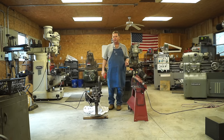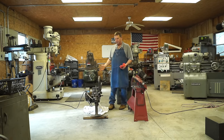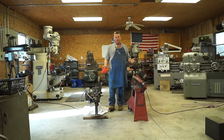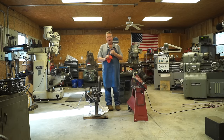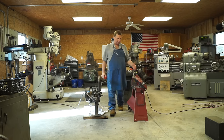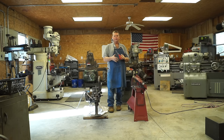My intention isn't to say the Marvel is so much better than Harbor Freight. What I want to show people is: if you can find one of these saws laying in a field somewhere — this one was sitting in a field for 30 or 40 years and I wire-wheeled it, lubricated it, and replaced a couple of things. The Harbor Freight saw is brand new with a relatively new blade. Both have 10 TPI blades with about the same cut time on them.